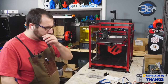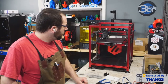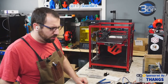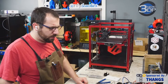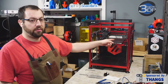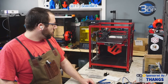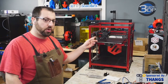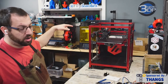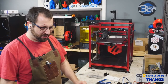I goofed. I forgot to write those numbers just now. It was 250 and 233, I want to say. You have to put in your config, and I'll show you here in a second, the location of your switch. I didn't do that. So what happened was, it defaulted to go to like 0,0. So hopefully you have enough time as it slowly moves across to realize you goofed and kill the power before it drives the hot end into the bed.